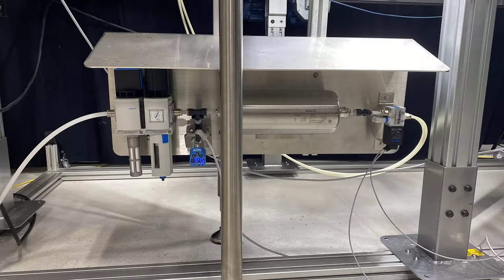Here's the main air reject panel. You can see we've got a regulator coming in as well as a lockout tagout shutoff. Next to that we have a pressure transducer reading 94.5 psi. If the pressure drops below 75 psi we lock out the system. Followed by that we have a two-liter air tank for surge — if you're shooting multiple products off you need to handle the surge pressure. After that we've got twin high-speed solenoids for the reject.